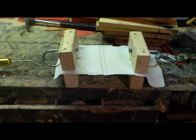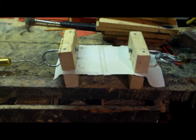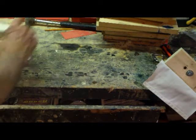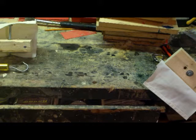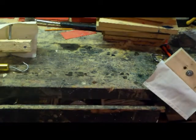Shit. You're upside down. Well, the telltale's on this, so I guess it'll work. Failed. Okay. Let's see where we failed at. Seam to seam was better. That's interesting. Seam to seam was better. This failed at 29 pounds. Okay. That's much better.